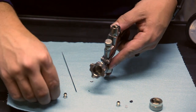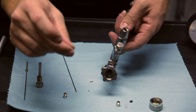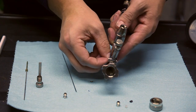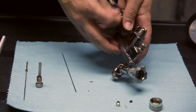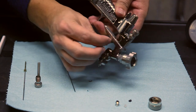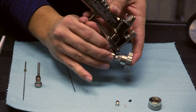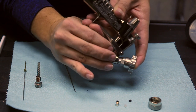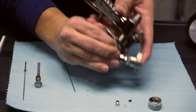Once it's there, this leather packing goes down — the black side goes down first, and the red side should be facing you. Once that's complete, pull the trigger up to give you more room, go ahead and tighten the packing down. Make sure it's nice and snug, finger tight.